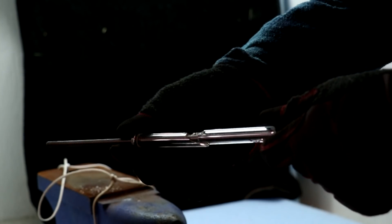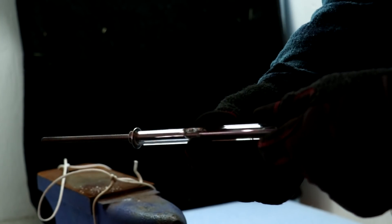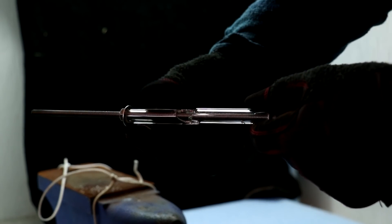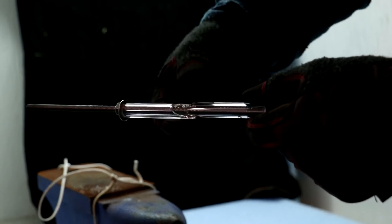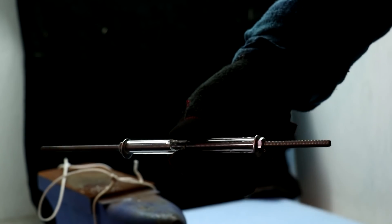And that's exactly what's happening with the tempered glass. Except, instead of a bolt, what we do is we heat up the glass so it all expands, and then suddenly cool the outside. So the outside contracts, and then the inside contracts. So the inside gets put under tension, and the outside is under compression — just like this little model here.